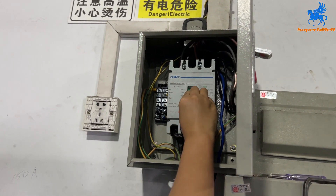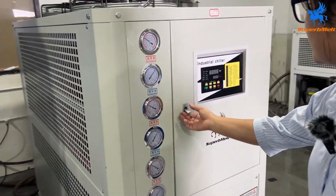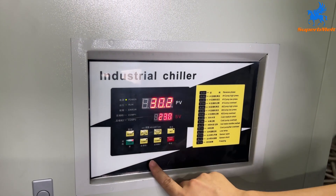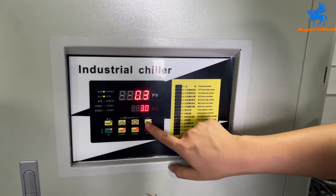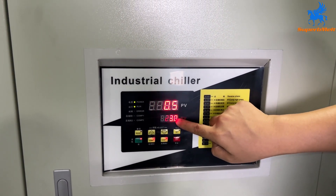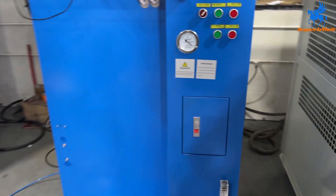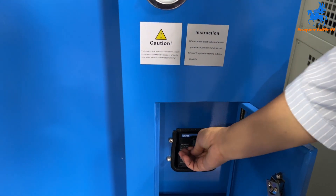Let's operate the machine. Let's open the machine here. First, let's open the chiller — open the pump, compressor one, compressor two. If you want to set the temperature, press setting and use temperature up or temperature down. Normally for the continuous casting machine, you can just set 23 degrees. After you open the chiller, let's open the casting machine and open the main cable.